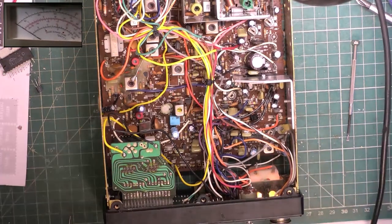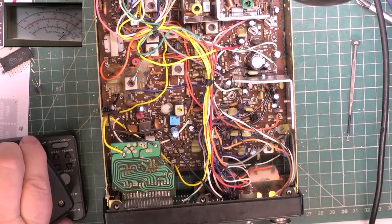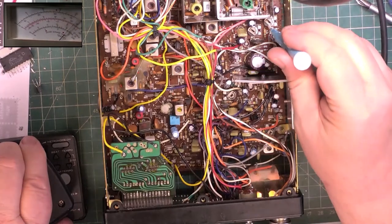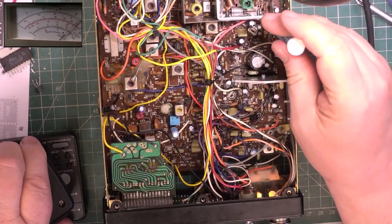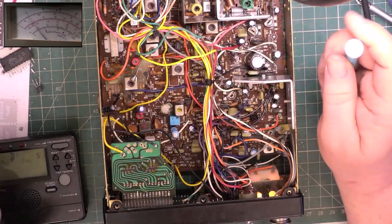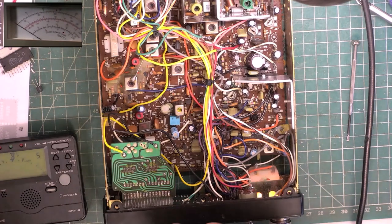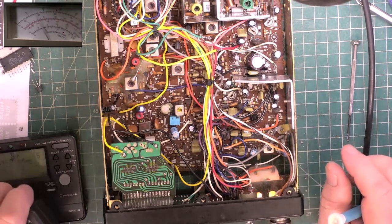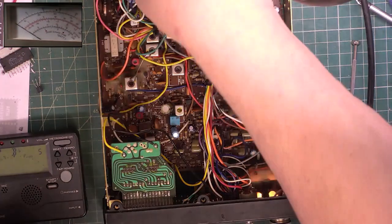I think this radio's probably not worked since the 80s. It's clearly been around the houses a lot. You only have to look at the fact it's got a soldered-in speaker, and people have kept putting it on one side. The audio IC had been replaced, and it certainly looks like a used one went in. Did that work for a while, and then it failed again? Anyway,